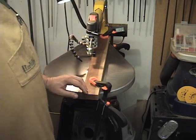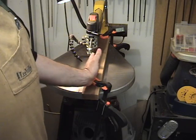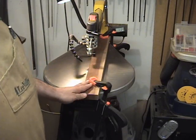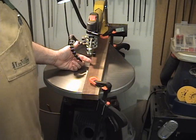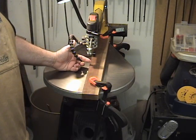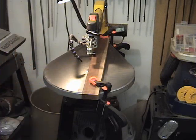In this case my clamp is set pretty straight front to back on the saw, but you may have to adjust this angle to compensate for the drift of whatever blade you're using. I'm using a number seven; a number nine might be a better choice here. The thicker the blade, probably the better off you're going to do. With that, I'm going to zoom in and give you a closer look.